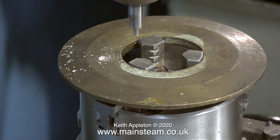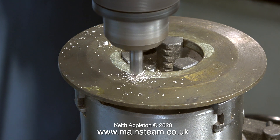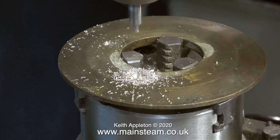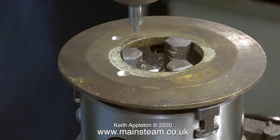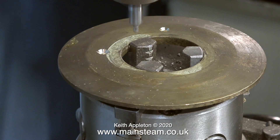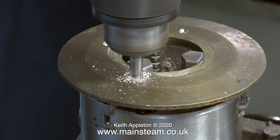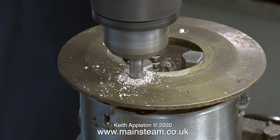This rotary table saves me a lot of time — no real marking out required. You just put the part on, rotate it, then read the dial on the base of the rotary table. Rotate the table to where you want it; it's calibrated in degrees of a circle, which is 360 degrees, so by using a small amount of maths you can drill the holes where you want.